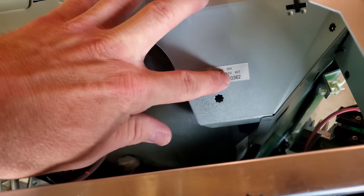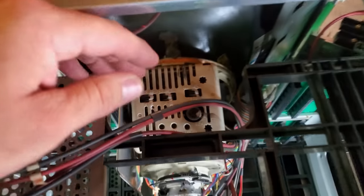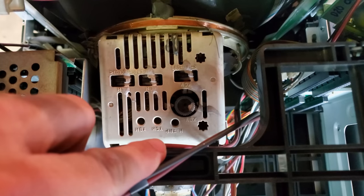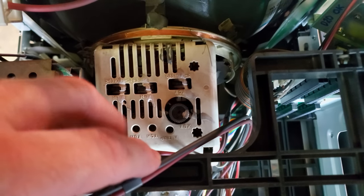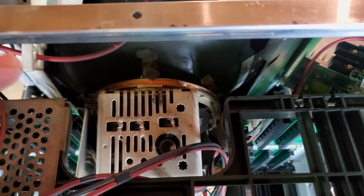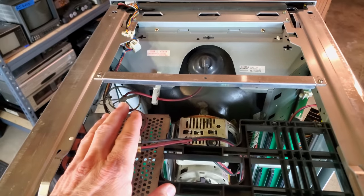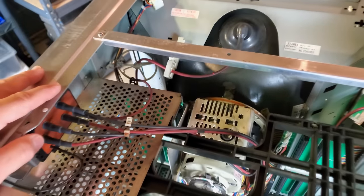This is an earlier model from 2000, but it still has a lot of great life left in it with not many hours. This is our deflection yoke — a higher-end deflection yoke with three holes labeled HTRP, YCH, and YBH that help you move along the vertical axis, with another for horizontal convergence tweaking beyond what can be done in the service menu. This monitor has an incredible service menu for adjustments, and this yoke also has the ability to tilt the picture without physically moving the yoke — so if you have a tilt issue, just get into the service menu and fix it.